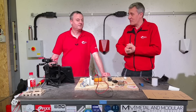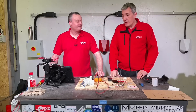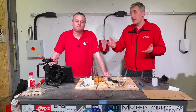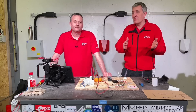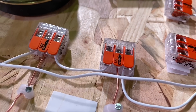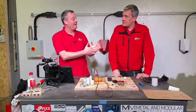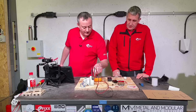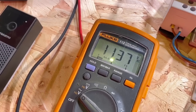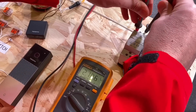The other problem Gary is that we found our 8 volt transformer wasn't outputting 8 volts — it was generous, it gave us nearly 15 volts. Yeah, and that's the other problem you've got when installing smart doorbells: you're trying to add something to a circuit that perhaps wasn't initially designed to have smart electronics fitted to it. You have to fit in with what's already there, and that obviously changes by manufacturer, by different types of bell, and even by the wiring. The wire supplied with these kits has got a lot thinner than it perhaps used to be. So we got 15 volts out of something we expected to get 8 volts out of. You've got another bell transformer here with different tap-off points set at 0 to 8 volts — bring in the camera: across that first tap you can see it's giving about 11 volts.